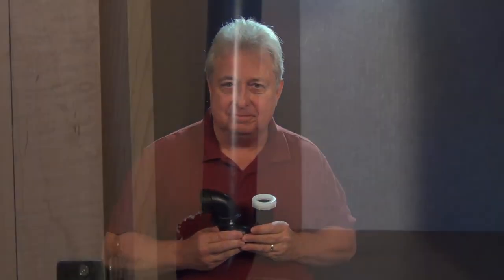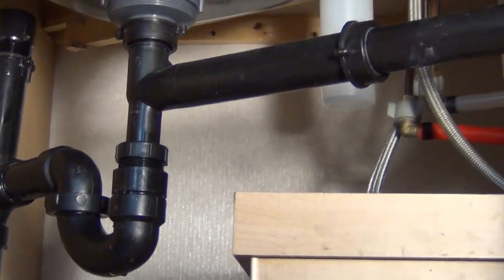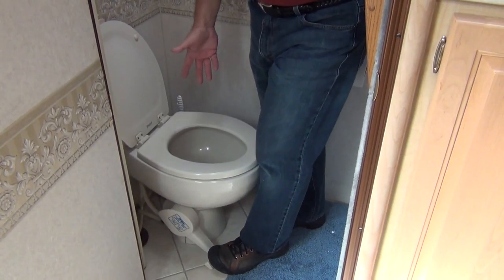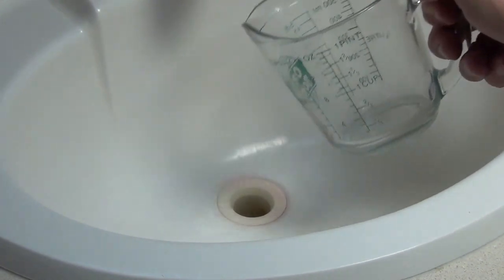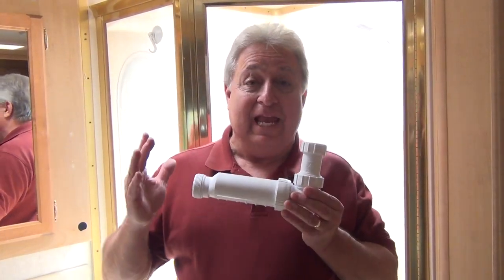Unfortunately, we rarely use RVs as often as we use sink drains in a conventional home or apartment. Therefore it's quite common that the water in the P-trap can evaporate to the point the water lock is lost and vapors and odors are free to travel up and into the coach. Holding tanks have an inherent positive tank pressure that forces odors up and out of the tanks. Also as RVs round corners on mountain roads, it's entirely possible to have the water siphoned out of the P-trap. And in some RVs that have the lavatory sink plumbed to the same black water holding tank as the toilet, the flushing action of the toilet can also cause the water lock to be eliminated. When HEPVO valves are installed, there is never a need for RV antifreeze for winterizing since no water is retained — no water, no risk of freeze up. With HEPVO sanitary valves, none of that is a concern ever. Simply install it and forget about it.